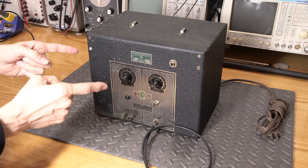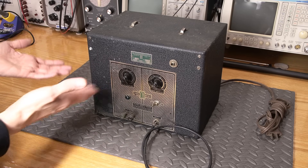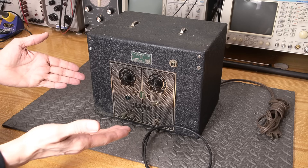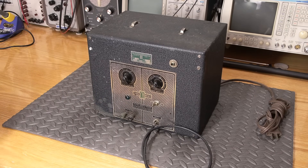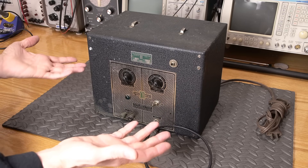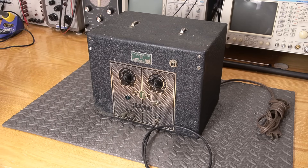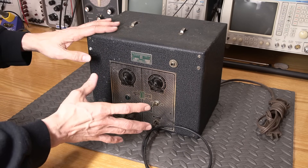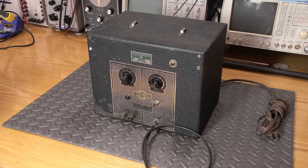This is a frequency modulation device from 1938. AM amplitude modulation was very common in radio receivers way back when, and high-fidelity AM was actually a thing. FM sounds the way it does today because AM used to sound very close to that. They achieved it by making the intermediate frequency — the IF section — in radio receivers rather wide, with a wide bandpass, which allowed proper sweeping and tuning to achieve that high-fidelity sound.